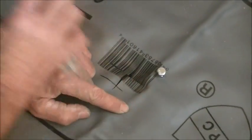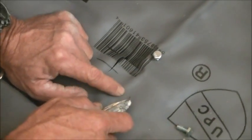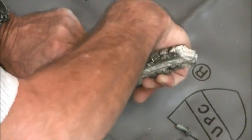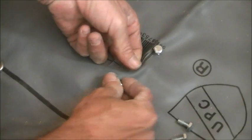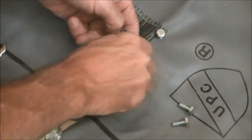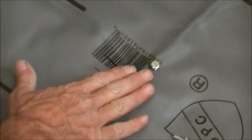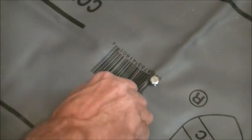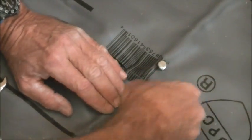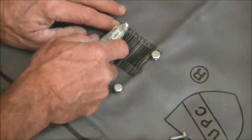Be careful doing this because you don't want to perforate the pan any more than necessary. You should have one perforation in the middle for the drain opening and four for the bolts — nothing more. If you mess this up, you'll have to start all over again. This is my way; you'll find other ways and I'm not saying they're right or wrong, but pushing the pan liner over the bolt head makes no sense to me.